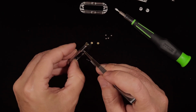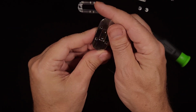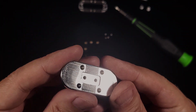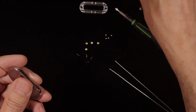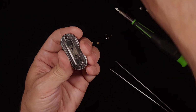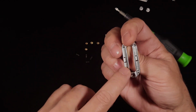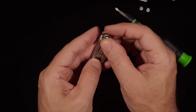Oh, here it is. I got out of order. And looks like I'm number 510. But you can see here where I put the tape. It's not very much. It's just enough, because that's what happens whenever you apply pressure to the top. This is riding on the springs, but when you push down hard enough, even though there's not much surface area here to make contact, these parts of the rail are metal touching metal.